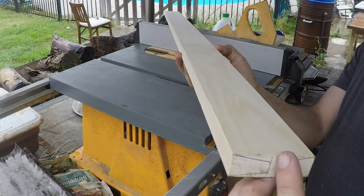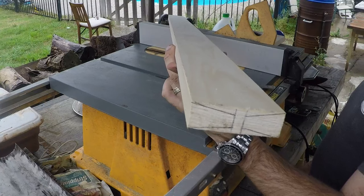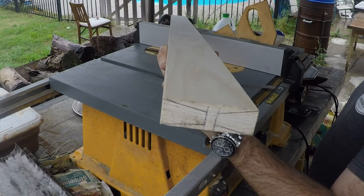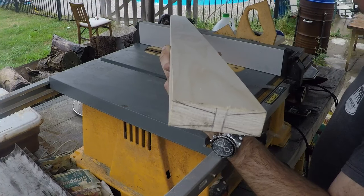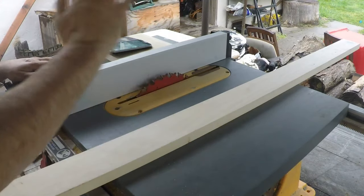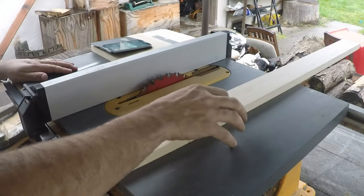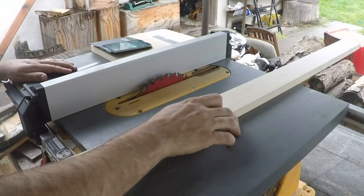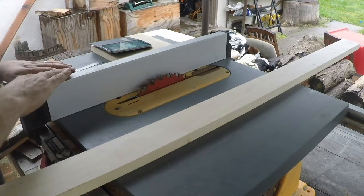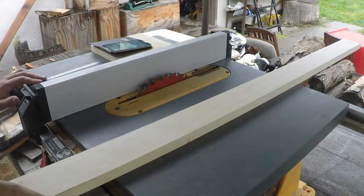We'll cut off the piece and it'll actually leave a little bit of a leg to hold this thing up while we're cutting it off — this is a good tip if you're going to cut bevels. You couldn't just stand it up and cut it, then flip it around and cut the other side; it's going to be really unstable and want to tip over. I've got the saw tilted over seven degrees, so that'll be 14 degrees of draft in this part. These are going to be pretty big cores hanging in the mold, so I don't want them to break off just trying to get the pattern out. The fence is locked down; we have to cut on the opposite side of the blade, and I think we're just about set to go.